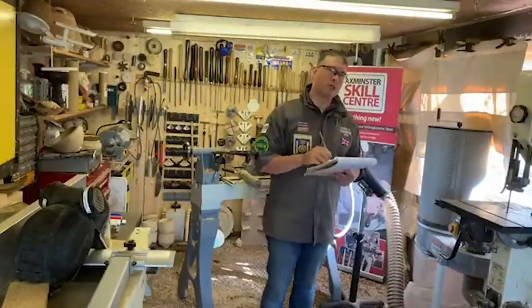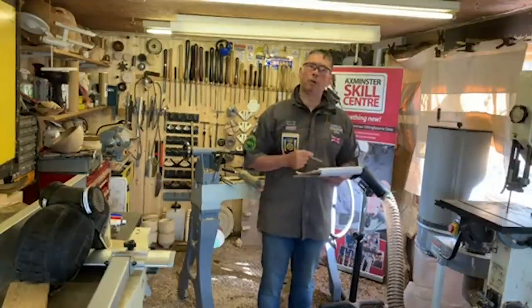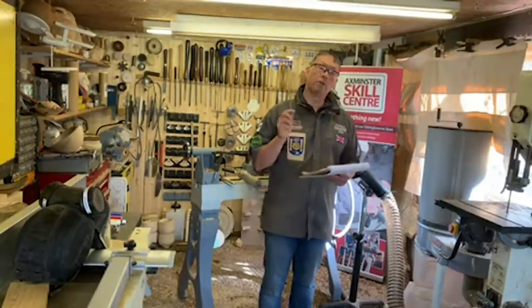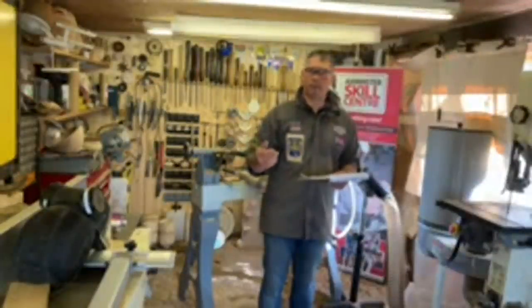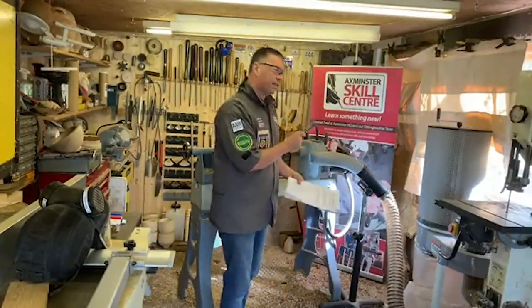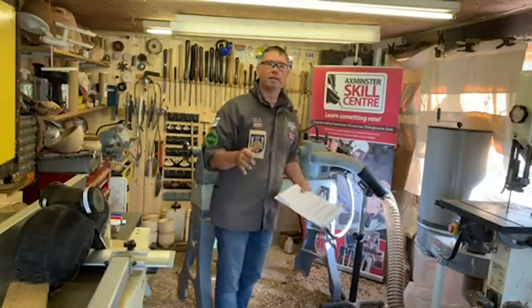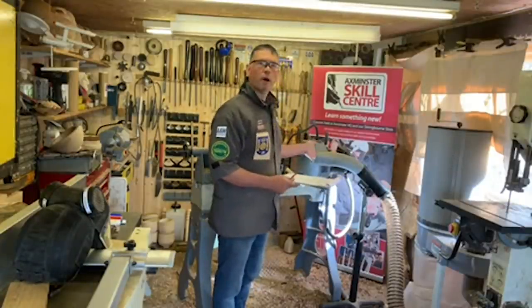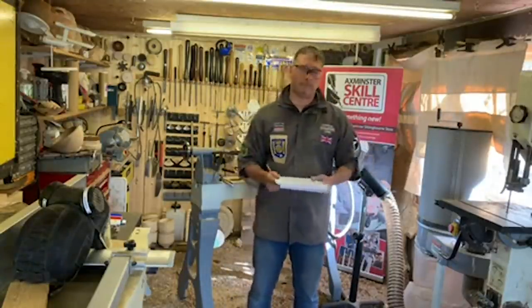So I would say, if you're looking to do something like that, go for the 170 or the Cyclone. If you're happy to do what I'm doing, go for the 60. That's the simple answer. And you're right, your selection is the right ones for what we're doing. We're looking at a good airspeed, a good airflow. If we want to pull from a planer thicknesser, pull from a distance from the lathe, we need that type of extractor. Things like vacuum extractors are great, but they need to be plugged into stuff. They're not going to pull from a very long distance away. Great suction at the nozzle, but then it dissipates the further away you go.